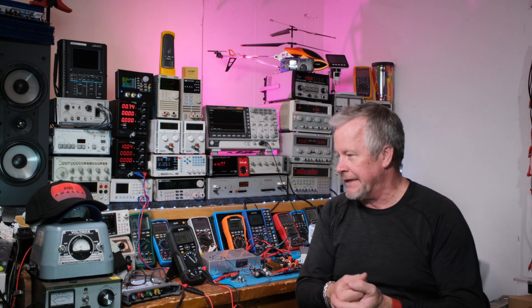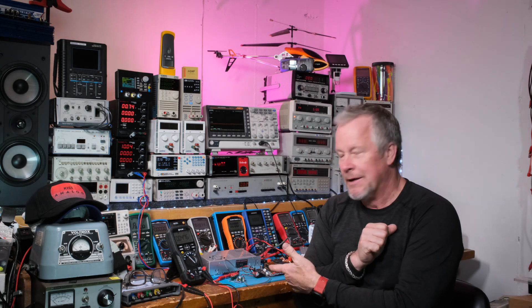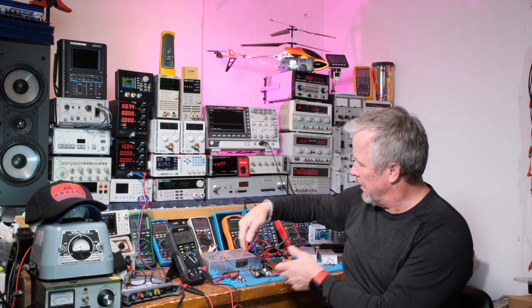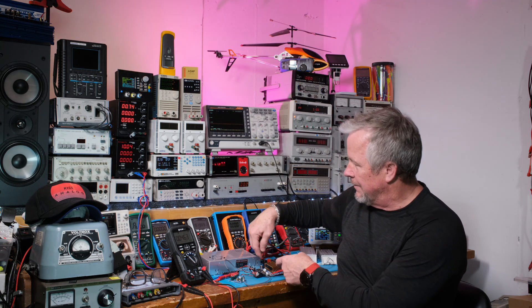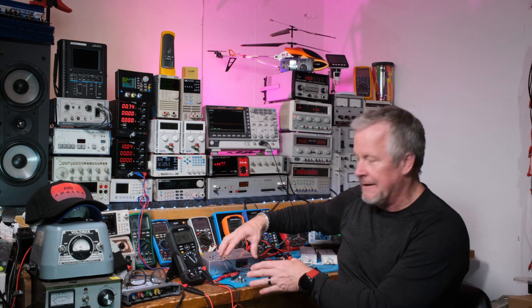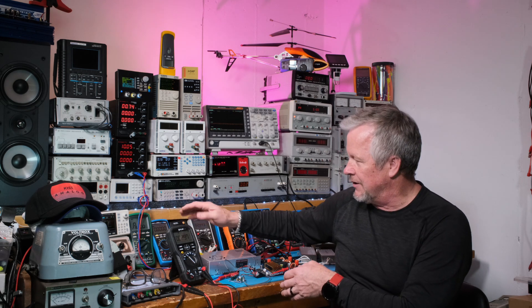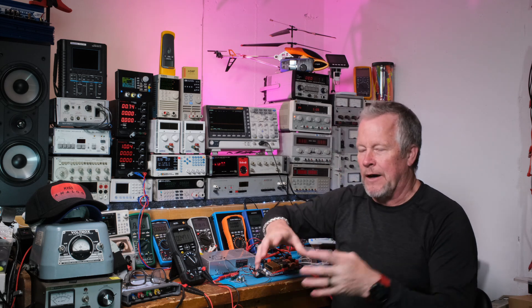I've got the switching power supply, the amplifier, and now I've got the preamp, so I'm going to start stuffing it in the box. The next video on this amp will be the assembly. For the preamp, I've got a power supply putting in about 10 volts. I'm going to run the voltage off a regulator on this board. For now I'm using the FLIR and its decibel function to measure voltage and see how much gain I get through the preamp.